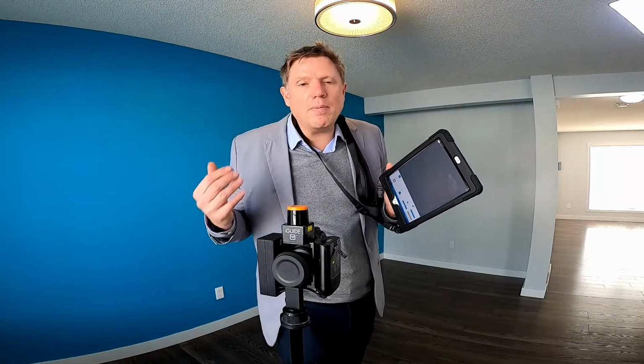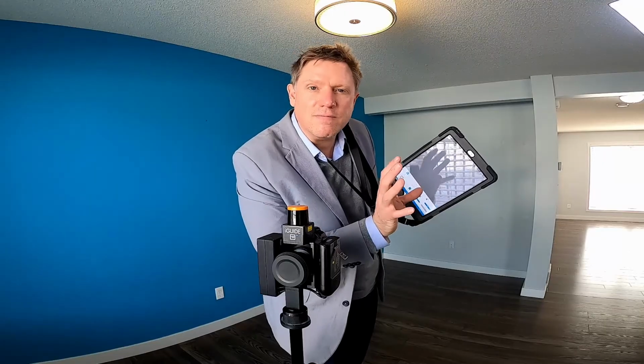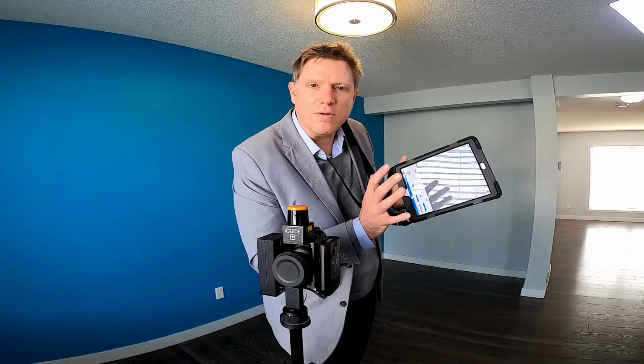So it's an optional step, but one thing I like to do before I start shooting the panoramas and getting the little individual jigsaw pieces of the floor plan, I like to put it into auto map mode and walk around and let the camera make a map of the floor that I'm on. Now remember, this is an optional step. It's a step I like to do so that all of my little jigsaw pieces of floor plan fit together automatically. Now don't worry, if you don't do this step and your pieces are not fitting together on site, you can fix it once you get in front of your computer when you're doing the post-processing. But if you choose to take a few minutes to do one of these auto maps, I think it's going to help you a lot in making a lot of the floor planning, a lot of the measuring go automatically, okay?